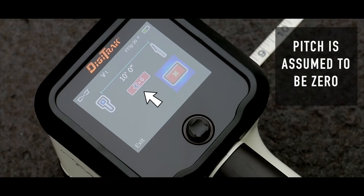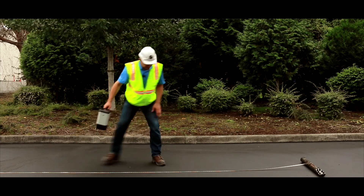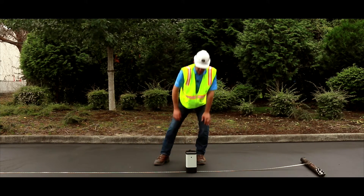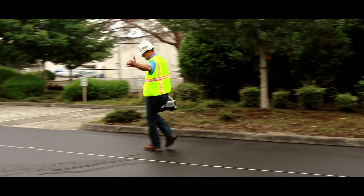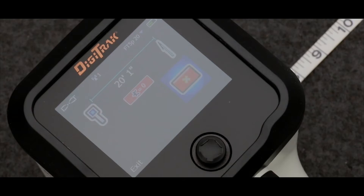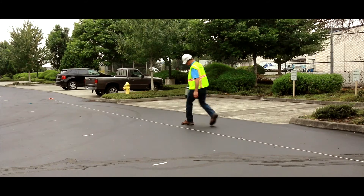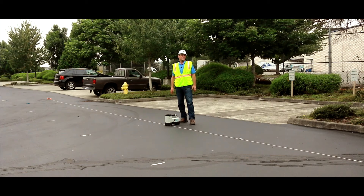This is where I confirm that I have a good calibration while I'm above ground. I'm going to take this in to five foot and see what it says — it says exactly five foot. Let's take it out to 20 foot — exactly 20 foot. Let's do one more — let's take it out to 30 foot. We're getting 30 foot right in between. So we've got a great calibration; we've just proved it.